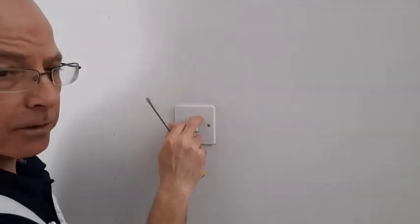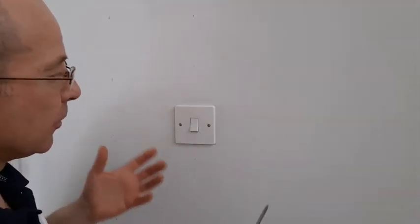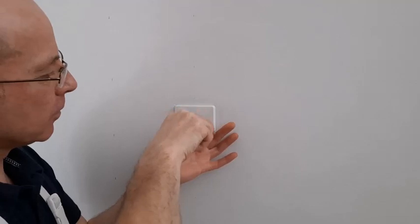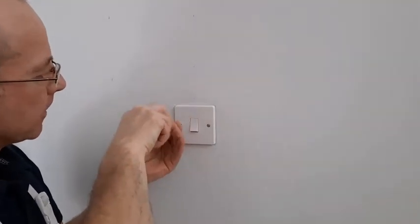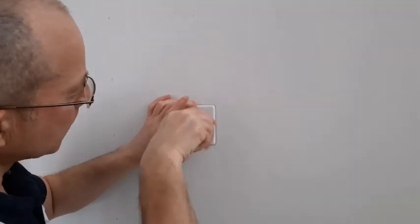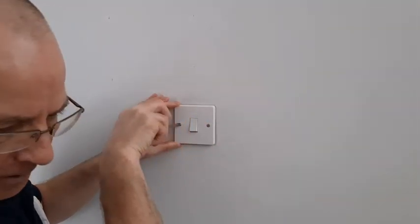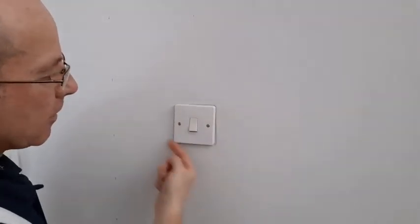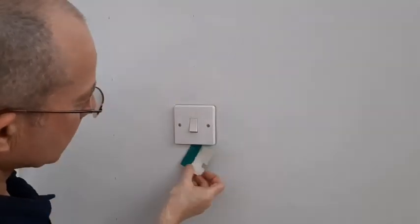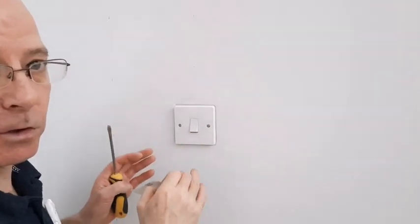So when it comes to doing sockets in a room, what you need to make sure you've done before you start the papering is your preparation. You've gone round and you've checked every socket, you've unscrewed it. Make sure it comes off the wall nicely, so you're gonna have no problems when you come up to it. Now, one important thing you've got to do is make sure the edge around is nice, so your paper is going to have no problem going down the back. You'd never want to stuff anything too far down the back, but also always make sure your electric's turned off.